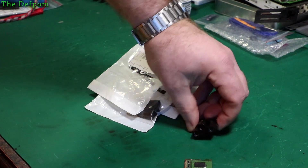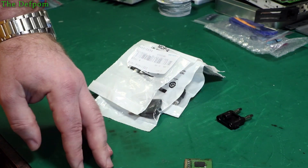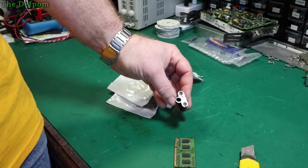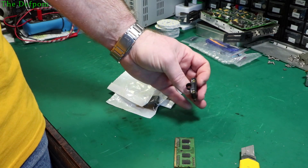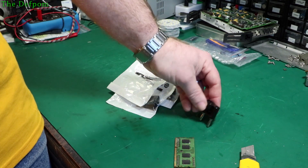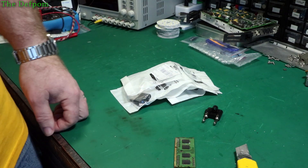The reason I'm going to do that is I want to make some shielded cables for doing some more precision references — when I'm working on things which require a lower noise cable. I'm just using a standard pair of multimeter lead kind of things, but I want to make some cables which allow me to have better noise figures by having the shield going to the ground side. I might even have to run a second cable with a guard terminal on it instead. I've got 4 of those, so in theory I should make up 2 cables with it.